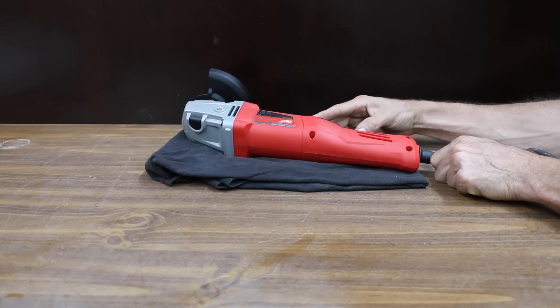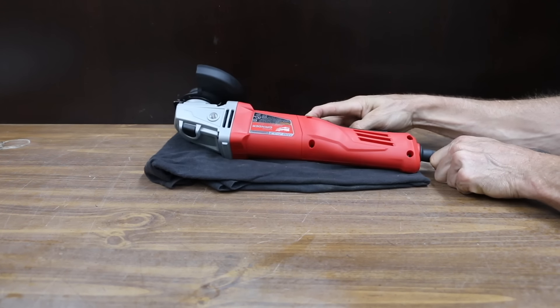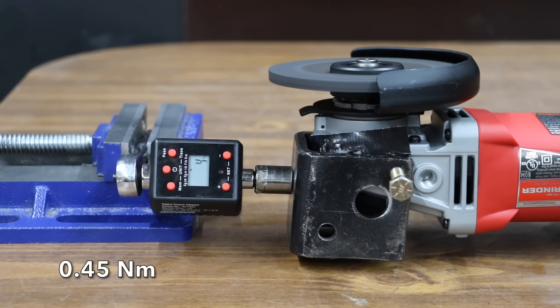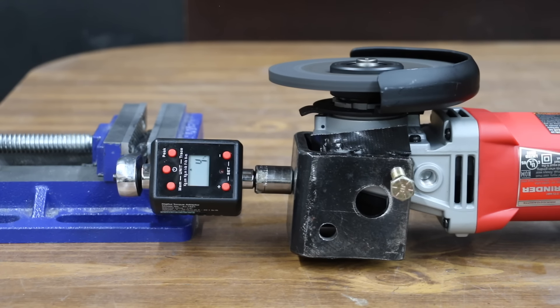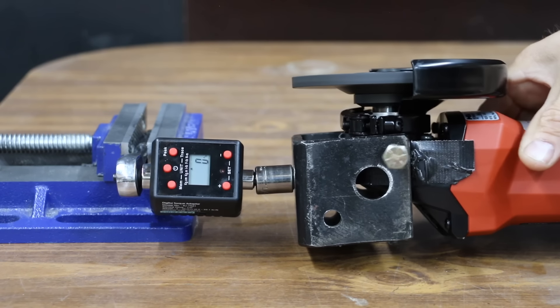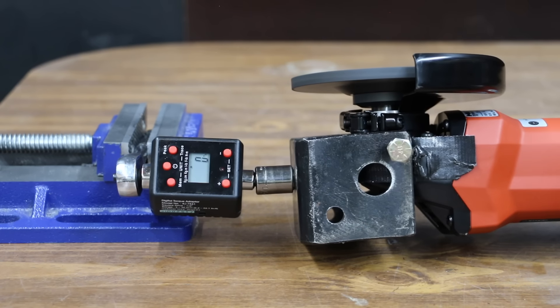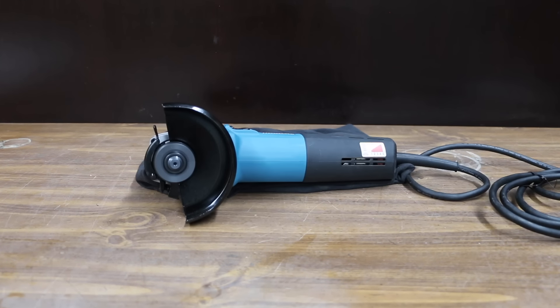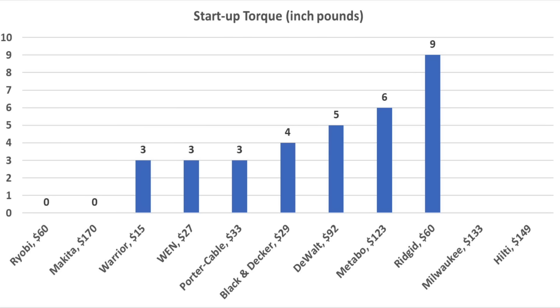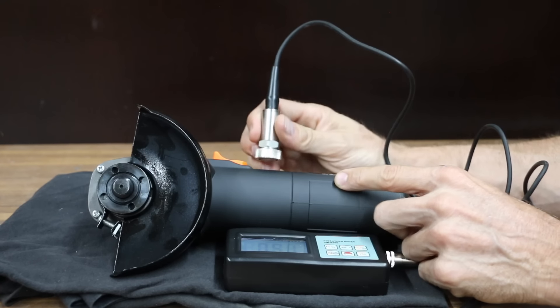The Milwaukee has a built-in safety feature that won't allow the tool to power up if the switch is already in the on position when first plugged in. This may have affected test accuracy, so those results are discarded. Similarly, the Hilti also has a built-in safety feature, and applying pressure to the switch interfered with test accuracy, so those results are also discarded. The Makita rolled over gently compared to most other brands, and its startup torque was too low to be measured by the torque adapter. If you're looking for the least tool reaction, the Ryobi and Makita offer the softest starts, while the Warrior, Wind, and Porter Cable didn't react too much at only 3 inch-pounds.